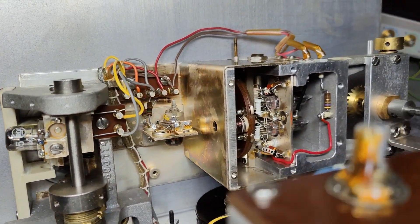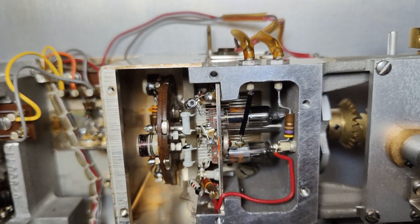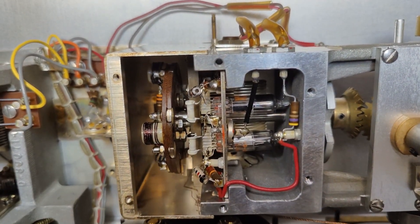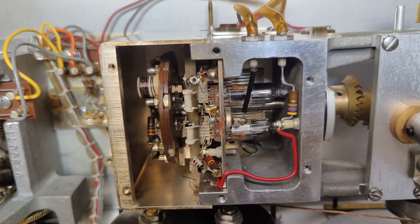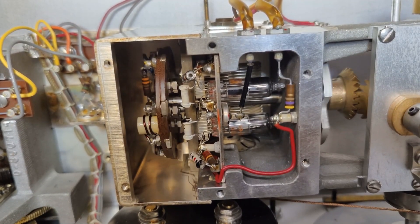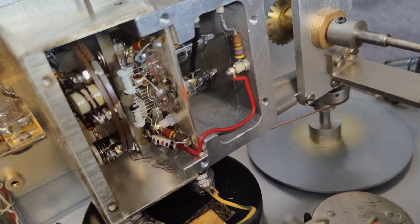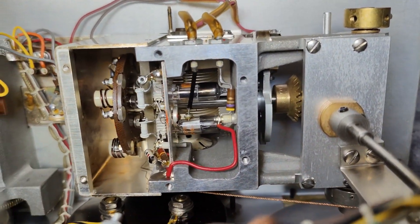I also opened into the oscillator, and this is done using two 5718 triodes. They run 6.3 volt filament, and it is of course a push-pull coupling. That will be the frequency bands — so it's a carousel switch and it's really tough with the click-clicks. The solder job in here is just amazingly well done. Look how beautiful all this is done here — I am totally impressed.